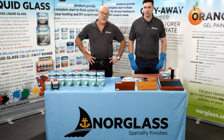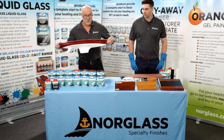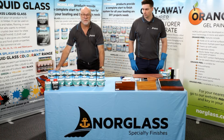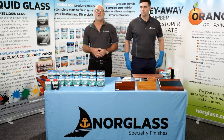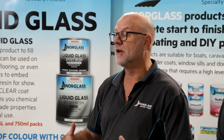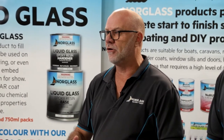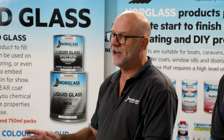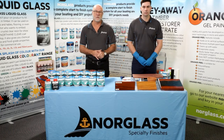Northane being a two-pack polyurethane is used in a number of different applications — obviously on boat hulls, on caravans, on vanity units, on bar tops. Northane is actually food grade and chemical resistant. Food grade basically means it won't harbour bacteria in the surface, so if you drop food on there and you eat it, no harm done. Chemical resistant — if you've got bar tops and you drop alcohol on there, no harm done. Or in vanity units, if you drop perfume or aftershave, it won't mark the surface at all.